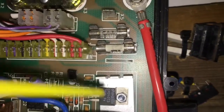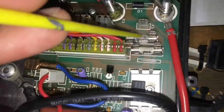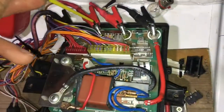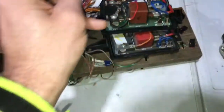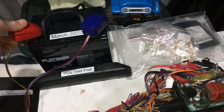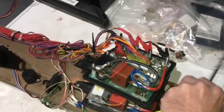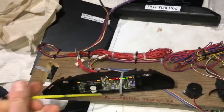Deeper investigation showed R1 had proceeded to burn out the IC1 chip, which is quite common as those two are linked together. That then links down to IC2 which is also fried. It also blew one of the fuses - we put a new one in. Some connections here were also slightly loose, so we retightened those. The relay is still good luckily. Connecting it up now - lights look good, checking the throttle for the motor.